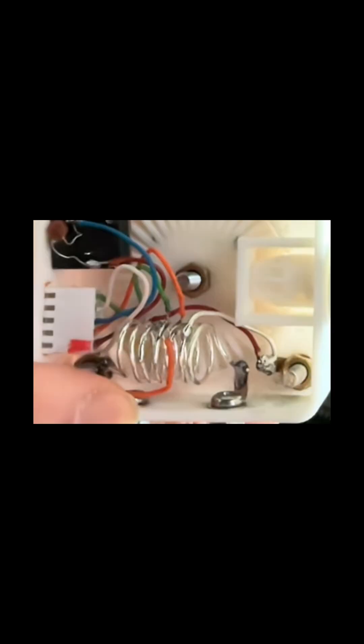Small FM coils are coils wound using 1 mm copper wires with a diameter of 10 to 20 mm and 5 to 6 turns.